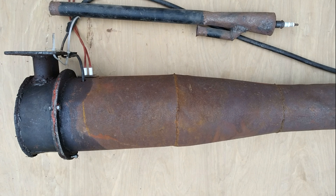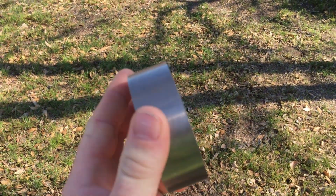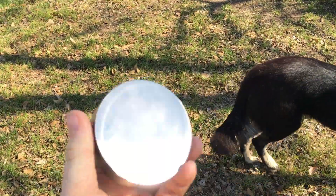The titanium valve was by far the hardest part to make, and it's the reason why this took me three years to finish. Liquid titanium burns when it's exposed to air, so casting wasn't an option. If I were to try machining it from a billet, I would need a billet that cost a thousand dollars, and 90% of that material would be wasted as chips, so that wasn't an option either. My initial plan was to buy roughly the volume of titanium I needed, forge it into roughly the shape of the valve, and then machine it from there so I wouldn't waste any material.